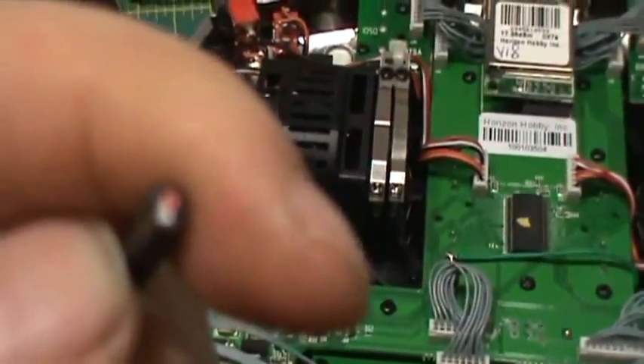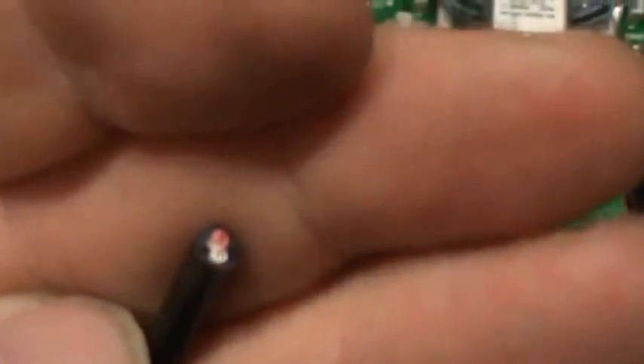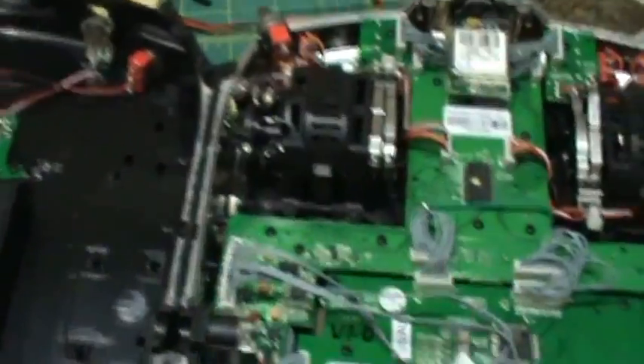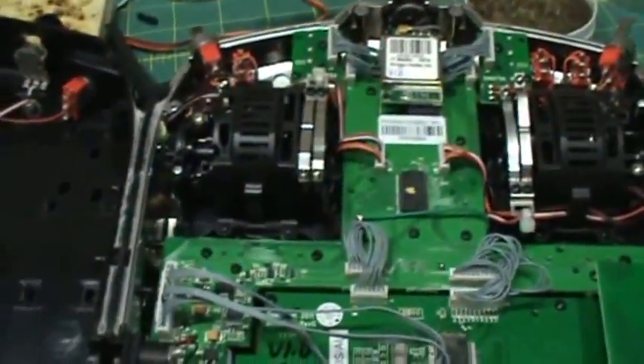Your yellow goes to the white. Basically I stripped back and got rid of the negative, which is the bare copper, and the red is the positive. So I multimetered it and made sure the continuity was correct.